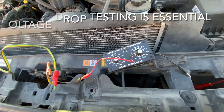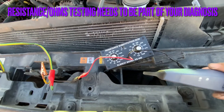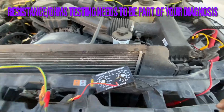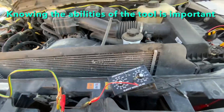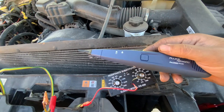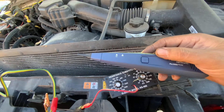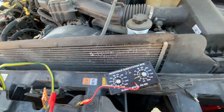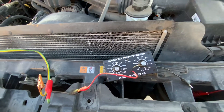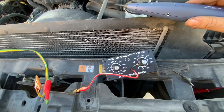Every case is different — you've got so many variables. I tried to put in the resistance box and a light bulb, and you can tell it doesn't affect the tone because we're just trying to find the run of the wire. The limitation and purpose of the tool is to follow the run of the wire. The ability for it to carry voltage — that's a whole different story. That's when you need your meter and your ohms. If I try to plug in that light bulb and resistance box, it will start to smoke because it can't carry the voltage due to the resistance.